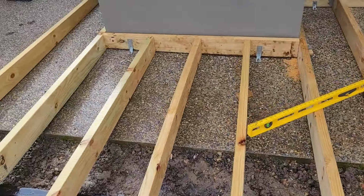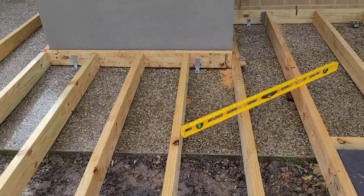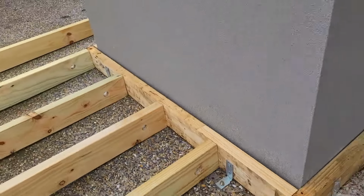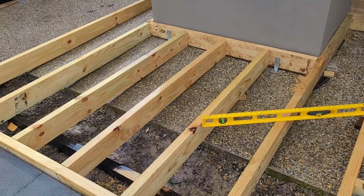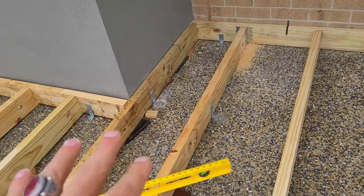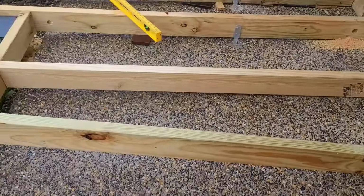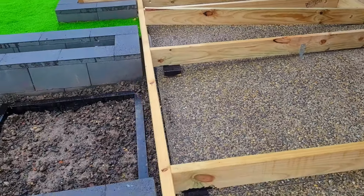So now the first step, as I mentioned, is to level those joists, and then I'm trying to attach those. I already made the holes for my electricity cables because later it will be difficult. Then once this phase is over, I will do the lockup. As you can see, I installed a few brackets to lock the frame, but it is not sufficient. Once I finish my frame, I will attach all those brackets and lock the frame wherever it is necessary.